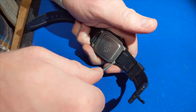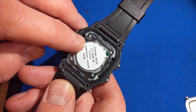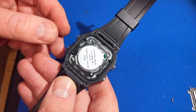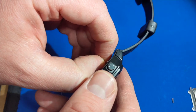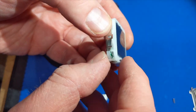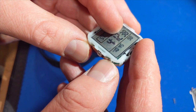Let's take a look inside. Now that we're in, you can see the module itself — there's the Casio logo. The module number says 3239 on it but the backing said 3240. Hopefully this is the right module and I'll be able to make the modification. The buttons just push into these little spring contacts and they share a common ground, pressing against the castellated edges of the PCB.